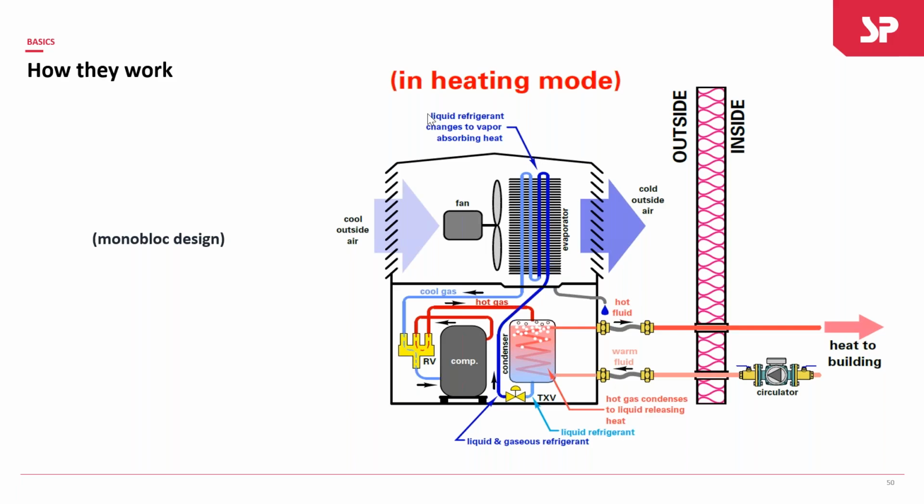And if you ever do call technical service or you do start up your first air water heat pump or you're working on an air water heat pump, you will learn by the end of this what having below a 10-degree delta and above a 10-degree delta mean. So these units, depending on the unit, flow different volumes of water, and they come out of the building, in this instance, heating up and going back in. So 10-degree delta, we could be in heating mode, we're coming out maybe at 90 degrees. By the time we pass through the system, we're heading back into the house at approximately 100-degree water.